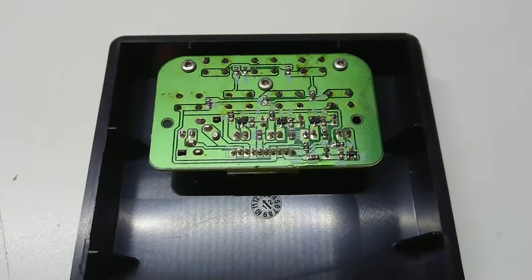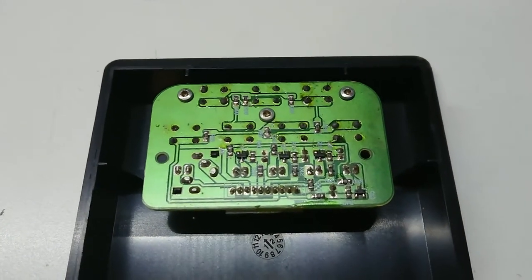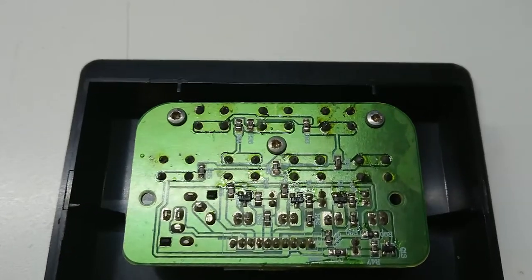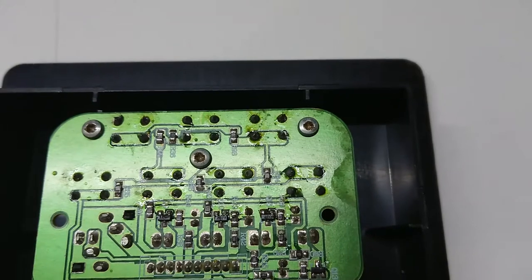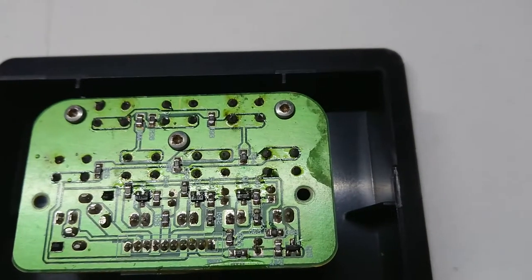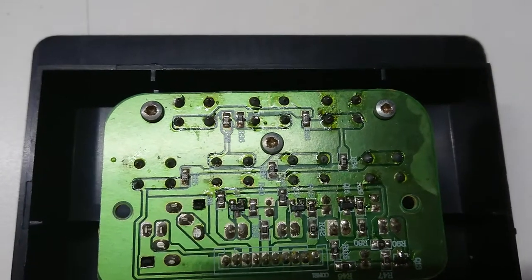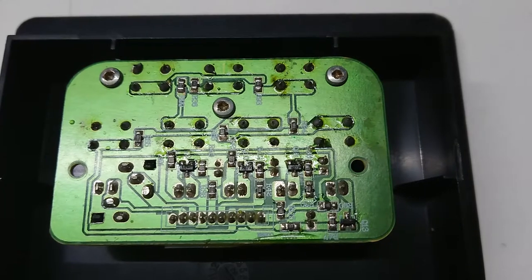So, first order of duty, and in the interest of working smarter and not harder, taking a look at this circuit board from the top unit here. Just because it's the easiest to access, and I can see from the screws here that somebody's been here before me. And there's a bit of excess solder here, and some dry solder joins. Some pretty bodgy work that doesn't look like it's come out of the factory. It's even bodgier than factory work. That and the stripped out state of these screws, certainly not something that is my handiwork.